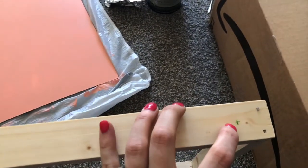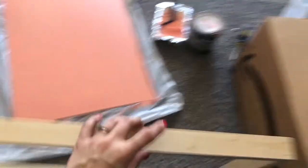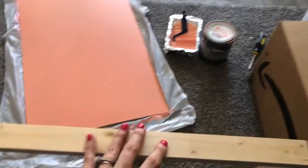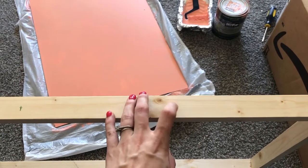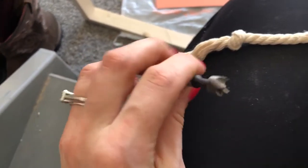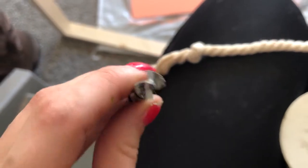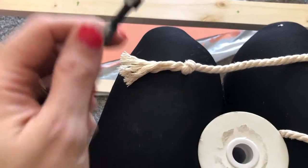I'm going to drill a hole on the side at 1¼ inch from the top, then 9 inches down, and then another 9 inches — so the three hole positions are at 1¼, 10¼, and 19¼ inches from one end. I'm going to have three ropes total. I'm drilling circular holes just big enough for my rope to go through and tie a knot on the side to secure it. I'm using a ⅜-inch Forstner bit, which drills a really clean hole. These are my favorites — they come in a little set — and I love Ryobi, so let's get to drilling.